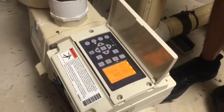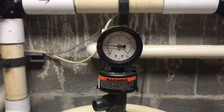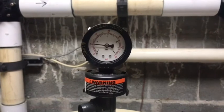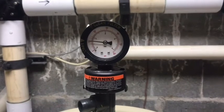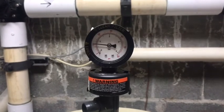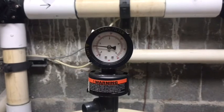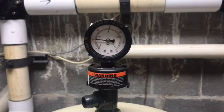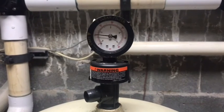She's on two and she's running. We'll check our pressure — that's what you do every time you turn on the pump or change the valves. It's a good indication of the health of your system, and if anything's going wrong, it will tell you right away. She's steady at around 11 PSI, which means we're running good. If that pressure started to rise and kept rising, you would immediately shut off the pump, because that would be an indication that your return valve was closed and pressure was building up in the filter — a dangerous situation.